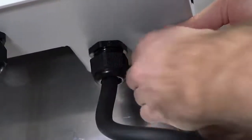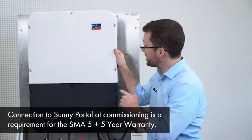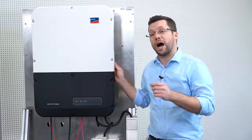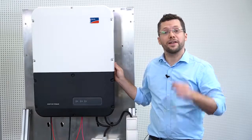And now we tighten the swivel nuts. That's it! The physical installation of the Sunny Boy Storage with the integrated secure power supply is now completed. The inverter now just needs to be commissioned via the web user interface and registered to Sunny Portal. You can view a video showing you how to commission your Sunny Boy Storage inverter by clicking on the link in the description below.